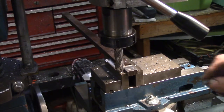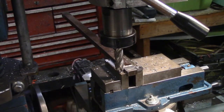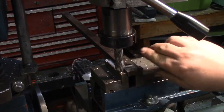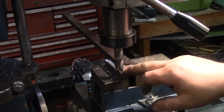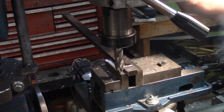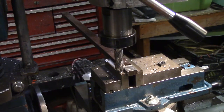I need to make sure that proudness of that tip is still going to be below centerline so I can do adjustments for the lathe. I'm right on the edge of being able to use it with the compound because I really did buy the wrong size tool holder. I'm going to take off another 10, maybe 20 — that was 60 there — let's go to 80.